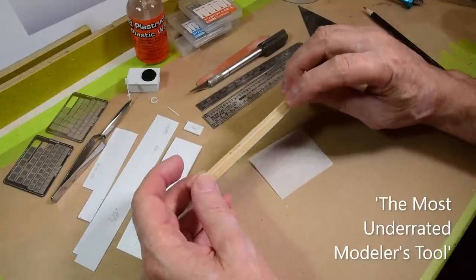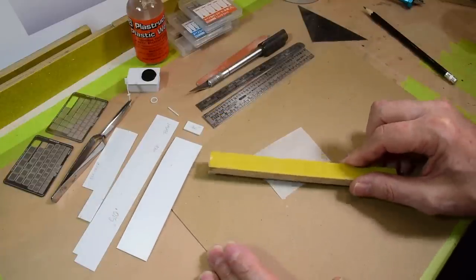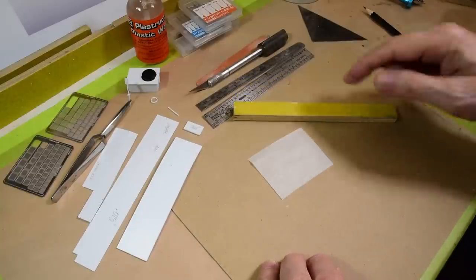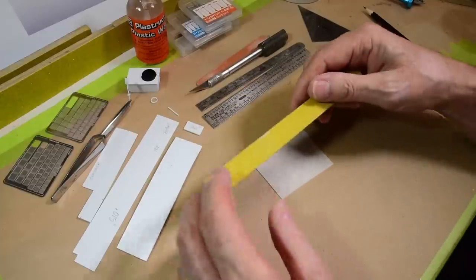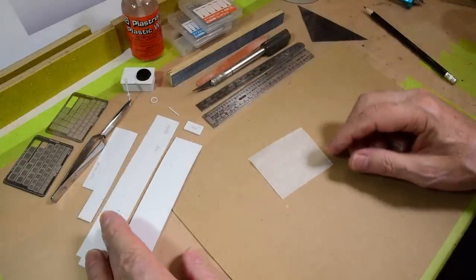It's just plywood strips laid on a sheet of upside-down sandpaper with white carpenter's glue. Just line them all up, glue them down, put a weight on it. When they're dry, knife them out and then flip them over and put a different grit the same way on the other side. I've had these since the beginning of River Road, and they're still good. So they'll last the whole project.